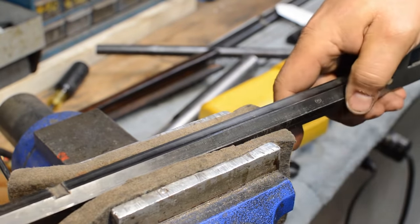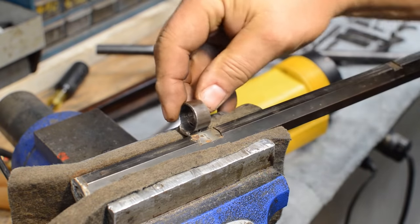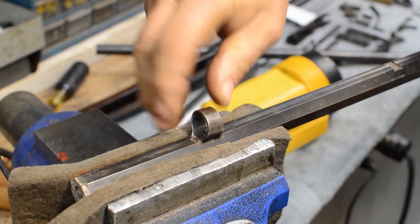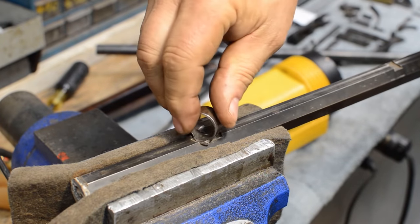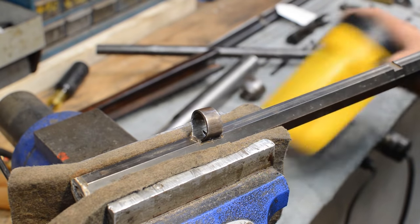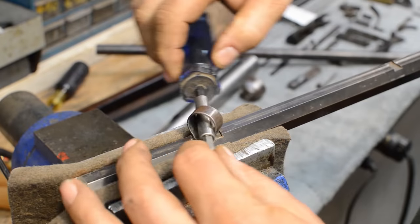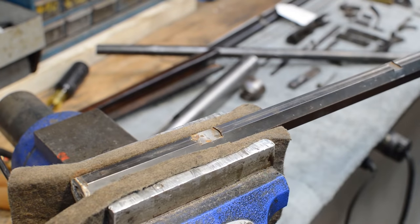There's something else you got to watch. You see this, and you think that this ring slides in and out in a dovetail, and it doesn't. It rotates. This rotates into a dovetail side to side like this. So if you try to drive this out, you will screw this thing up. Now this one, I'm going to tell you, I did a little bit of work on. It's a little bit loose inside this one. We don't know what it is in the regular barrel. But what you cannot do is stick a screwdriver or a bar or something through this like this and crank on this, because it will oval this thing. It will collapse it. I took the liberty of making up a tool here. Let me grab it. I took the liberty of just taking a brass bar.